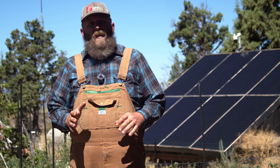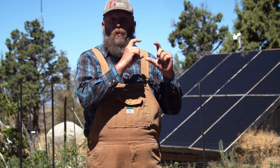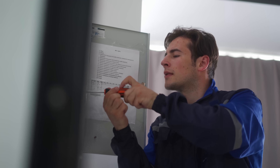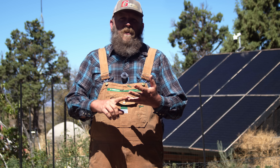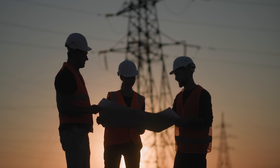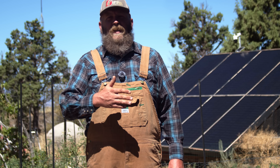As an aside, if you're not off-grid and thinking about doing the installation yourself, realize that all of those electronics are going to connect to the grid. If you're not confident dealing with household 240-volt electricity, you can do the entire install and then hire a service electrician to install the breaker and turn it on. In most cases when connecting to the grid, you'll need permits, inspections, and an interconnection agreement with the utility company, which increases your time and costs. Check with your local authority having jurisdiction.